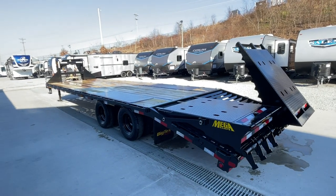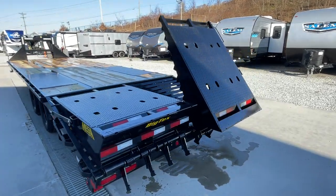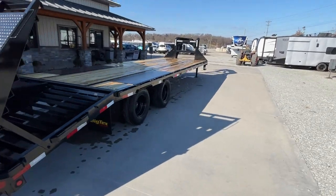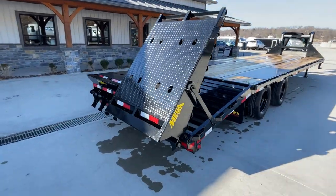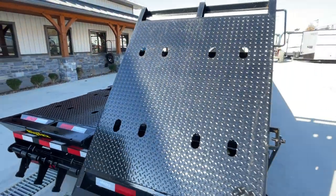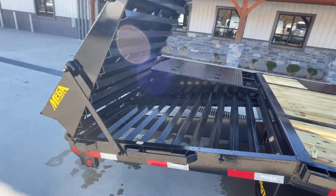HDSS is a 15,000-pound per axle suspension system — a happy medium between an over-the-road truck suspension and what you'd find on a normal 10k or 12k axle trailer. And as I showed you in the back, you've got your ramp flattened out making a flat level 30-foot deck, and then the ramp in the upright position is kind of pushed forward a little bit so you've got visibility to the lights — again, that's my assumption.